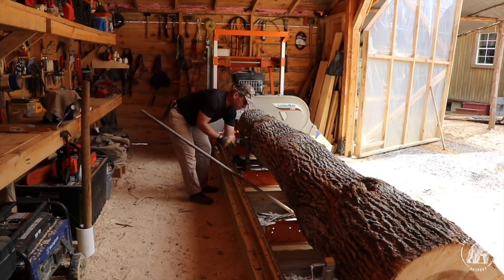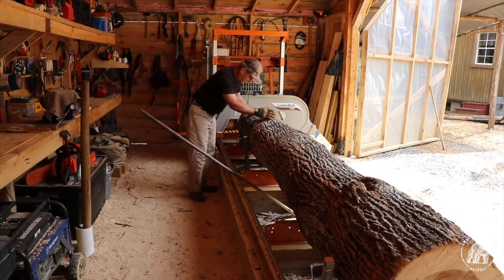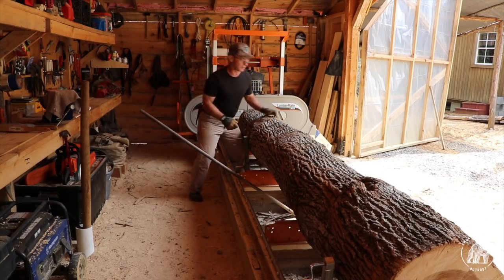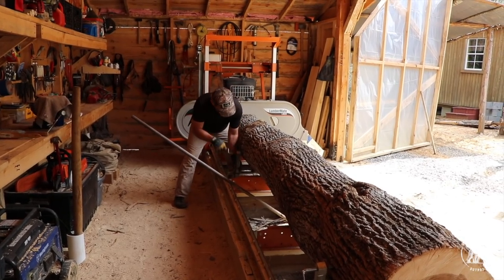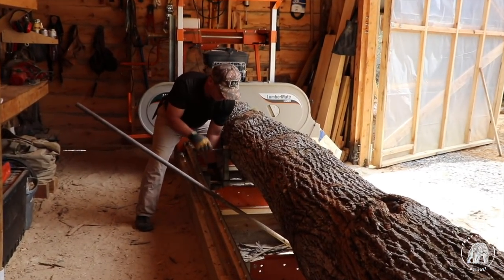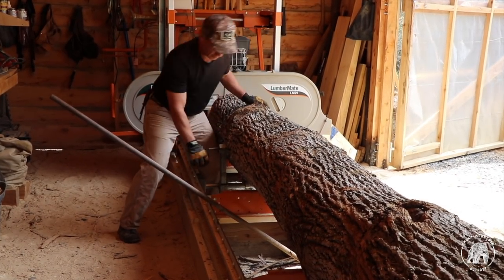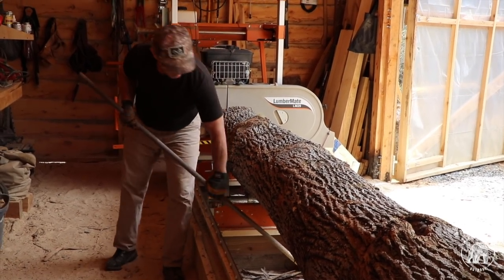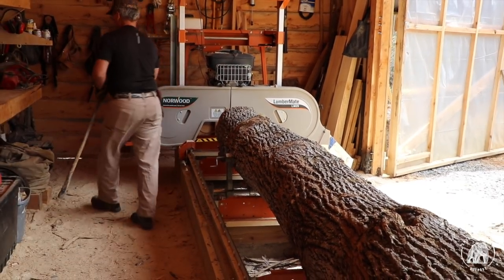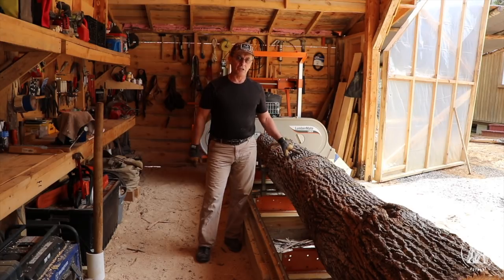Another response I got was about the knee bracing. I had mentioned doing the knee bracing when I had time because everything up here has to be scheduled around what other people are doing, especially if it's a major project and when I need help. I had one carpenter write to me and suggested that I use two by tens for my corner bracing because they're flat and they don't have to be notched out or anything and they're just as good.